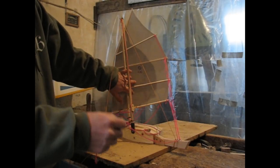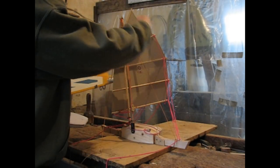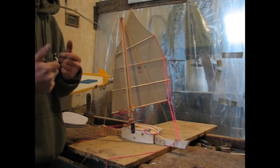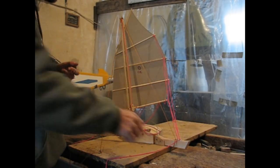It's an easy rig to reef, which is the most important thing, especially on multihulls. It's easy to handle single-handed. All lines lead to the cockpit. That's the amazing thing about the junk — the sheet leads to all the battens and you don't have as much sail twist as gaff rigs or other sail types where the top is twisting off. You don't have that.